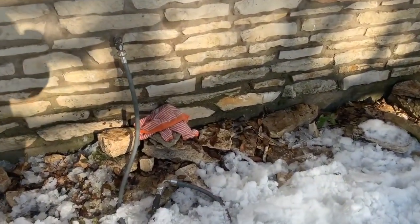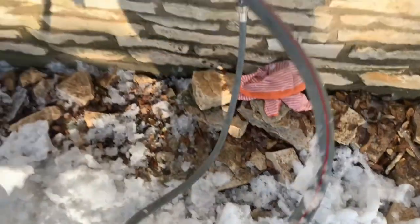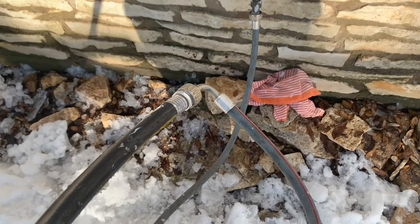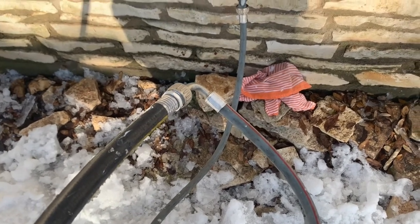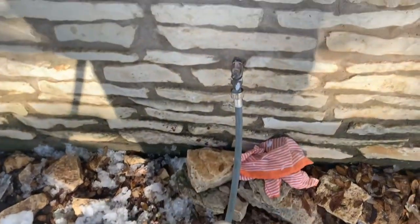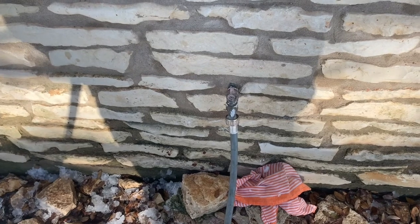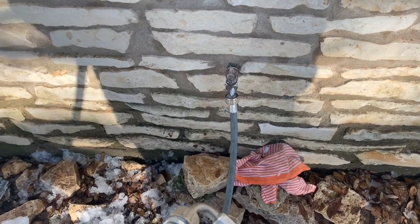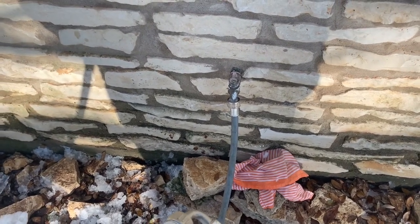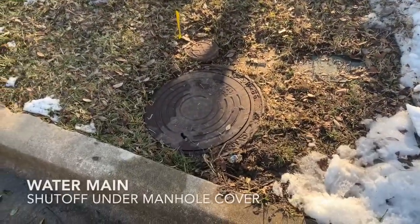The kind of secret was I needed a female-to-female connection, and it turned out what worked perfectly was an old hose for a washing machine, which happens to be female-to-female. That lets me adapt my hose connected to the filter into the house. This is where water normally comes from the house into a garden hose — now I've sort of pressurized it from the other side.